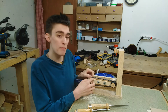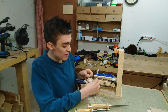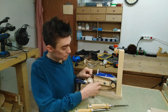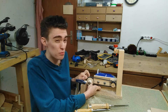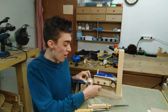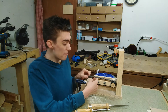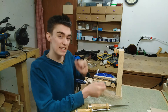I'm not gonna lie — the belt did jump off quite a few times, until I had the idea of stretching a piece of bicycle inner tube over the temporary pulley as well. That made it stay on for most of the time; it still jumped off once or twice, but once or twice is just once or twice. It would also help to use a pulley that is wider than the belt, because my pulley is 6mm and the belt is 9mm — that's a little different.